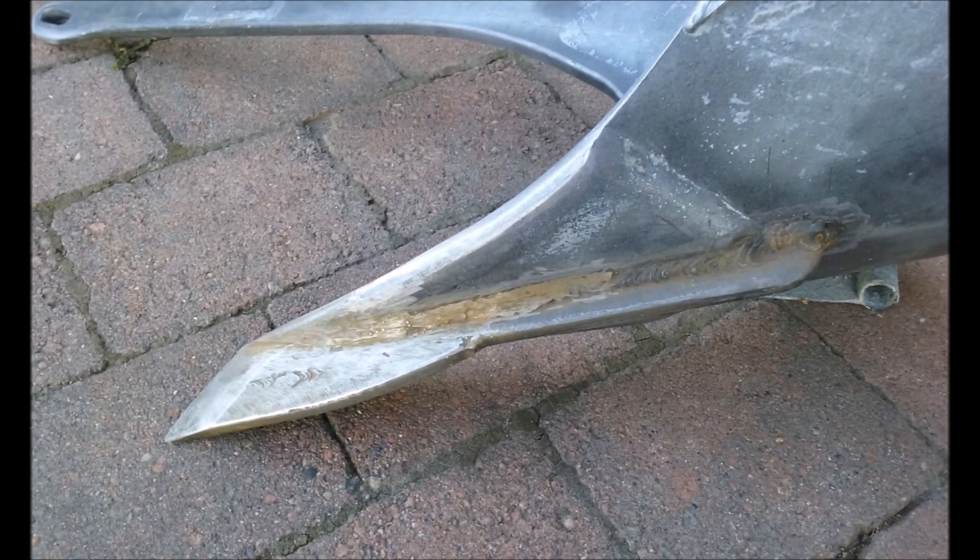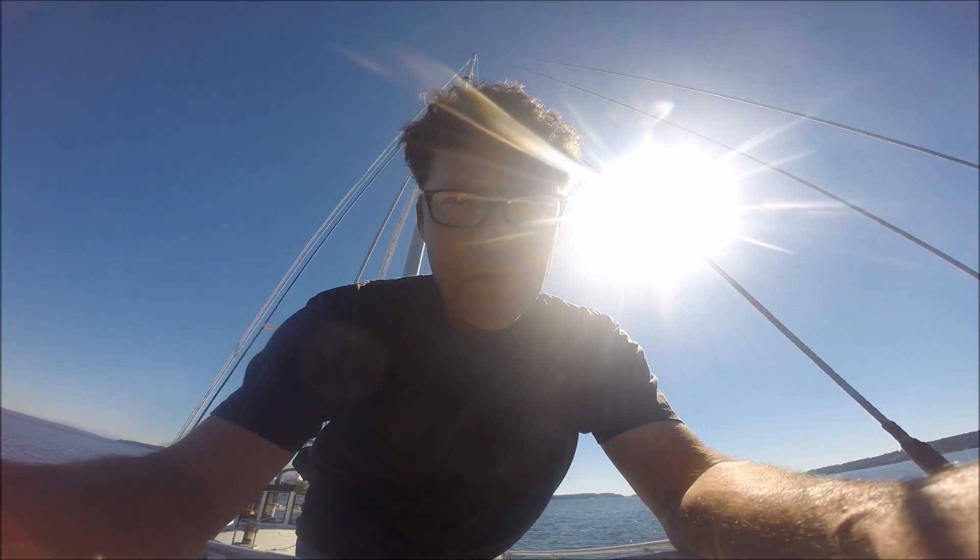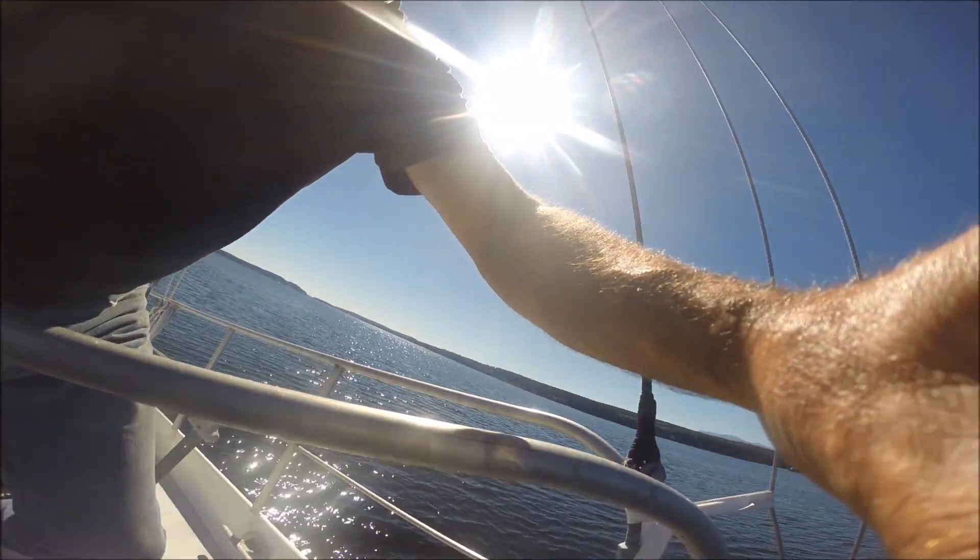So here we are at current time, this is a week or two ago. You'll see I've welded some material to the bottom of the fluke — that's actually leftover material from the shank that I cut off. I wanted to add weight, plus I wanted more of a chisel shape, and when the anchor lands on its side, I figured that point was going to be great. I was pretty confident — thinking I was the smartest anchor person in the world. So let's see what happened.